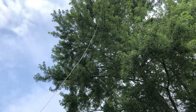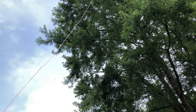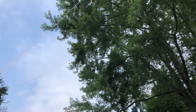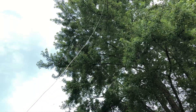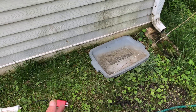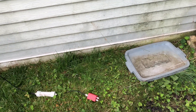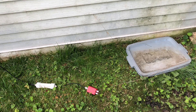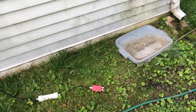On 20 meters I made my first contact on this wire — to a special event station in Quebec. On 40 meters it worked really well, SWR was low. That's about the extent of it at 39 feet. Nothing on 80 meters — I tried it but couldn't make a contact, so we're going to go with a longer wire.